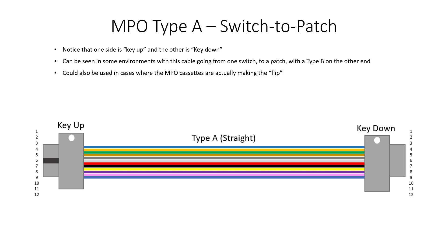For the most part, what I've seen is that you technically use Type B for this case, and it's the fiber plant that has everything straight through. My recommendation is, if you're connecting through cabling infrastructure, consult with your data center manager or network infrastructure manager to determine the type of polarity needed on both sides to achieve a connection using MPOs.